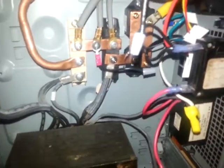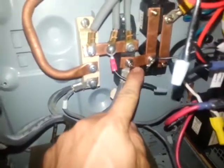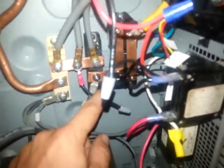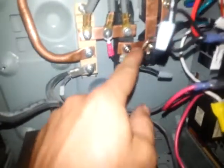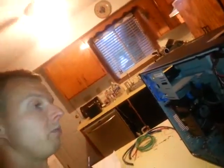Then it goes into the diode bridge here, which is a couple — or four — industrial diodes. I really wish I had all the same, but I didn't. One of these is a diode pack that has the AC coming in, the positive coming out, and this is the negative, so I had to come up with a creative way to wire that. Up here is a 200-amp current shunt for the meter. That did work, but I should have checked first — it only liked 12 volts and I opened it on full at 17 volts. I heard a pop, so that's the end of that.